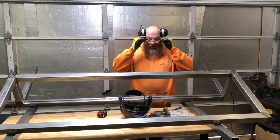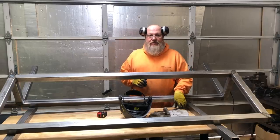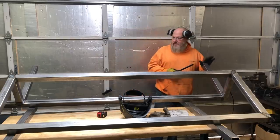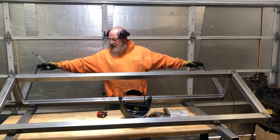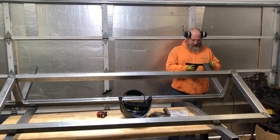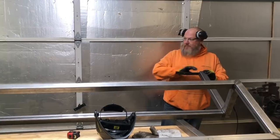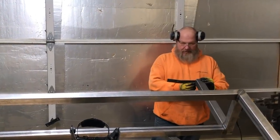I've got to build this wall structure in two separate pieces, otherwise I'd never get it through the door and I probably wouldn't be able to pick it up. I'm going to take this flat bar — these two legs are where the second half of the wall will mount — and cut a couple of pieces to make tabs with a hole in them that will bolt to the next two-by-two square tubing. It will be completely hidden.